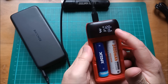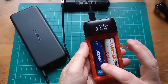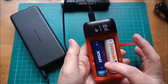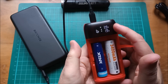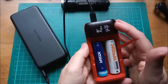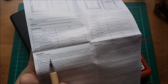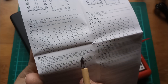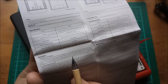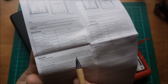This device has requested 12 volts from the RavPower and is pulling 1.5 amps — so that's 18 watts. In battery charge mode you can see the average percentage of the two cells, but pressing the button gives information on individual cells. Battery 1, the Xtar battery, is at 3.8–3.9 volts charging at 2 amps. Battery 2 is at a similar voltage also charging at 2 amps. The manual states that with fast charging, input is 9V 2A and each cell charges at 2 amps.